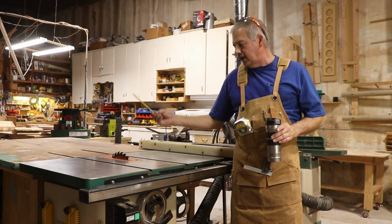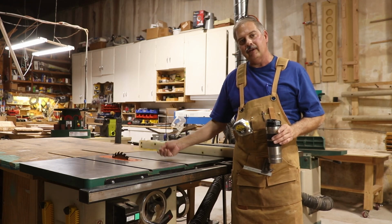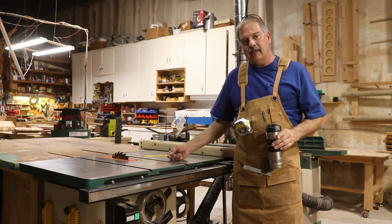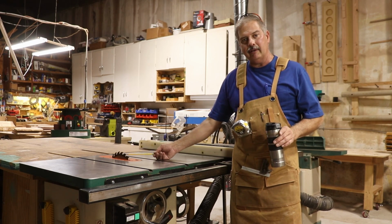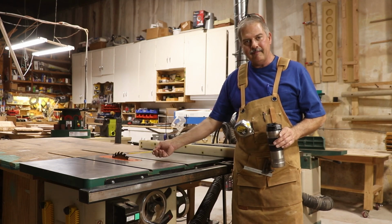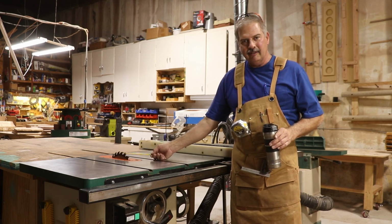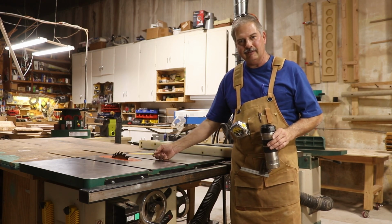It's heavy, it cuts a wide path, but when we take our boards off here, 90% of the time we can go straight to glue up without having to joint them. And that right there is the key to it. And you might think, well, how much would you have to spend for this blade? Well, instead of 150, 160 bucks, for my guys, it's a $50 blade. I mean, come on, 50 bucks compared to 150, and it'll do the job that the 150 blade will not do. More tips coming on saw blade choices and how to use them to make cutting boards and things.